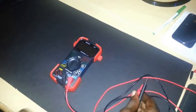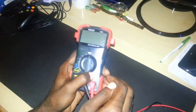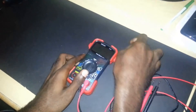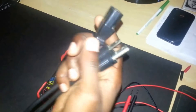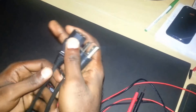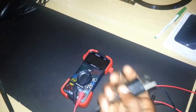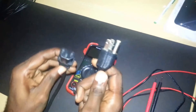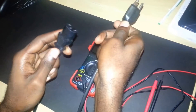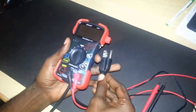One of the most useful things I use this to do is to test for continuity. This is a fancy term that basically means checking if there's a break in a wire. One problem I have is with power cords — sometimes your PC won't power on, and as I covered in my last video, the main cause can be a break somewhere within the wire. What you can do is use your handy multimeter to quickly test the wire that plugs into the AC wall outlet and connects to your PC power supply.